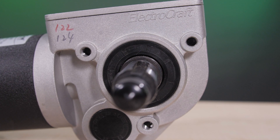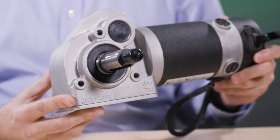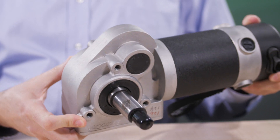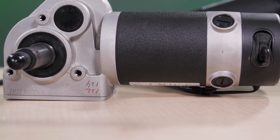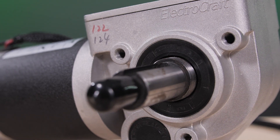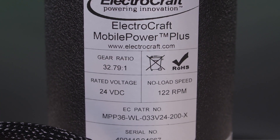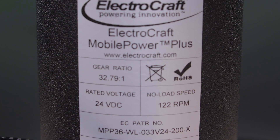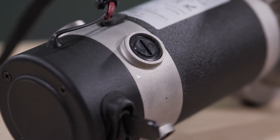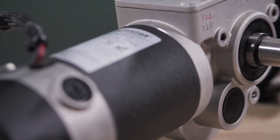From the MPP series, the MPP36 is a four-pole permanent magnet DC brush motor with a heavy-duty two-stage right angle gearbox. This gear motor is suitable for heavy load wheel drive applications that may require curb climbing in urban areas or traversing uneven terrain and off-road uses. The MPP series offers the same configuration options as the MP series, including permanent magnet DC or brushless DC motor types, industrial cabling and encoder options, allowing the MPP36 to be used for practically any type of all-terrain use.